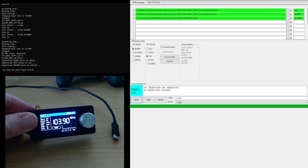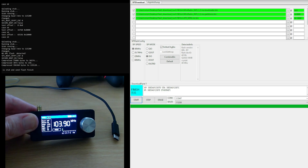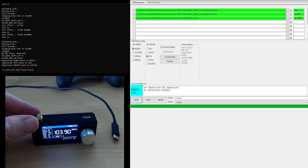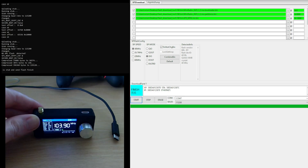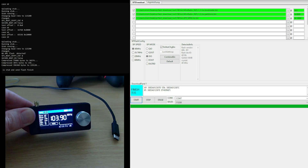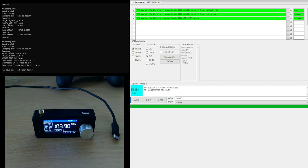Also, I know that there are units like mine which have the inverted screen. If you try to install other custom firmwares not meant for the inverted screen, the screen will come out reversed or inverted. I happen to be one of the — in inverted commas — 'lucky ones' that have the inverted screen unit of the Mini SI4732 radio. I needed to find the specific version of the custom firmware for my radio. I found one on the Facebook group — I'll leave a link in the description. I just changed some files over from a firmware version; I didn't actually create it myself. Just to let you be aware that not all of these Mini SI4732 radios are the same in terms of the hardware, nor would the firmware you want to install be the same.